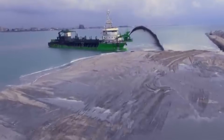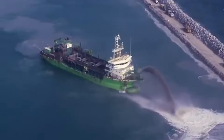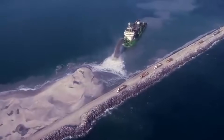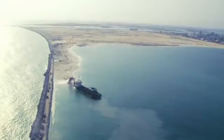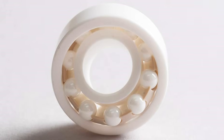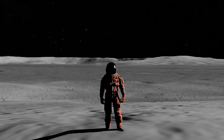Sure, we still spent a little energy scooping it up in the first place and screening it, maybe crushing it a little beforehand — but that's just the cost of doing business. But it's a different story for the non-metal regolith that came out after the impact milling step. It will have been turned into a very fine powder, which would make for an ideal feedstock for refining or for more precise sintering applications, such as the creation of thin ceramics for ball bearings or gears. So we might consider spending the energy to carry it back to our production base, and maybe we can think of this as the first step in the refining pipeline early on.